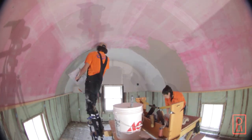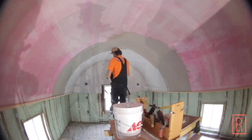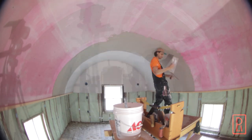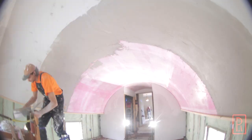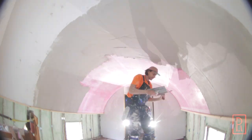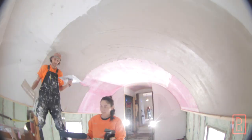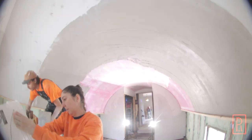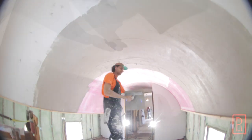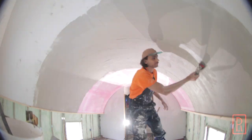You'll notice that after the first five feet or so, the plaster starts to get a lot darker. This was a real surprise to me, as we're using the exact same product from identical-looking bags — same manufacturer and everything. I still don't know why these look so different. I've never seen Structolite in this grayer tone before. To me, the grayer mud looked and smelled more like a stucco cement base than a gypsum plaster base, but there's no indication of this on the bag or on the manufacturer's website. If anyone knows what's going on, please put a comment below — I'd love to get to the bottom of this.